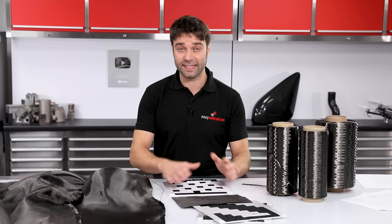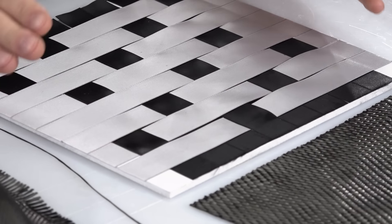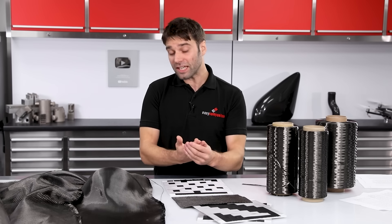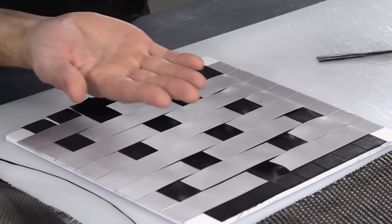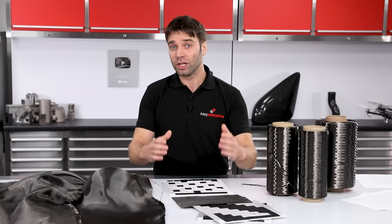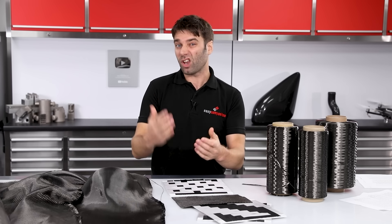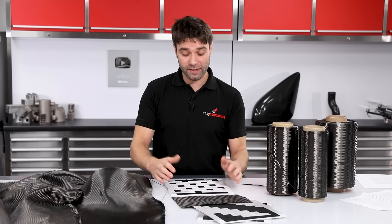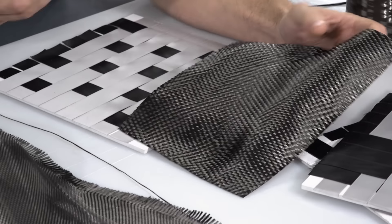This is a model of a five harness satin, woven by sending the tows over four tows and then under one in both the warp and weft direction. This does leave you with an imbalanced ply — most of the weft reinforcement runs on the top surface and most of the warp reinforcement on the bottom. So a single ply laminate would have a noticeable difference in how it flexes in one direction versus another. Overall, harness weaves have great drapeability and very low crimp, but at the compromise of being slightly fragile and difficult to handle.